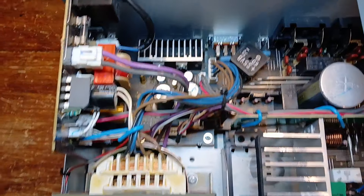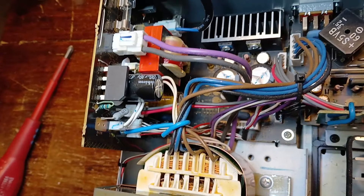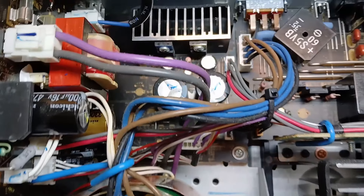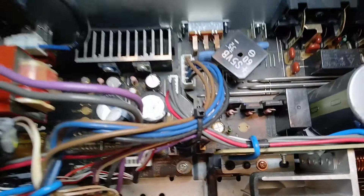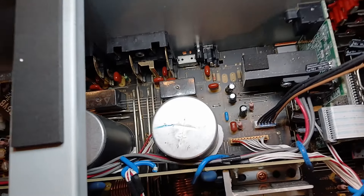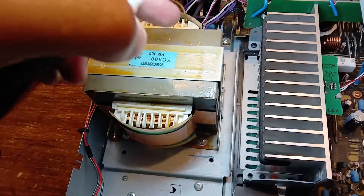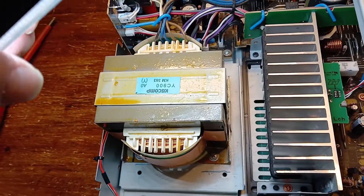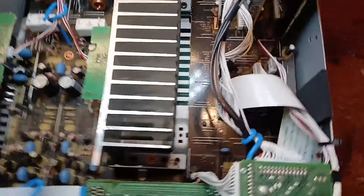Let's get you in for a closer look. It's a chunk inside, isn't it? We've got some ancillary power supply stuff — that must be for standby display and such. Looks like a voltage regulator board down there. This looks like a main rectifier board, and I guess those are some regulators on there. A couple of relays — I'd guess those are output relays. Got a main power transformer, a nice sized one. It's got to be pushing the 150 VA mark. Two heatsinks — one there, one here — these are going to be for the amplifier itself.